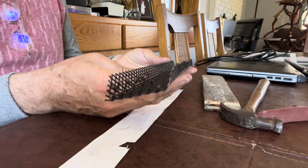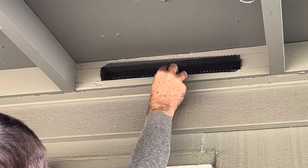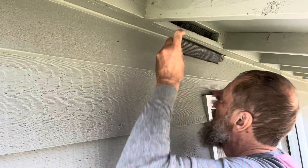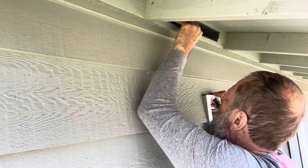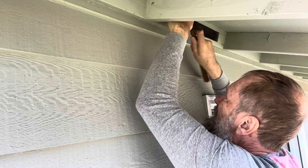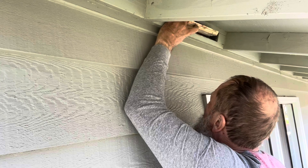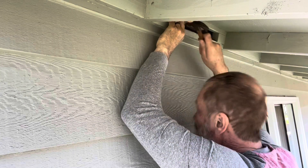I've intentionally left those edges sticking out a bit, so I will have to shove this piece into place. That springiness will help hold this piece in place — a kind of press fit. No need to secure from the inside on the attic side, no need to attach with nails on the outside. I tapped the thing into place, and I also brought along a strip of wood to flatten this against the existing vent that had the hole in it.